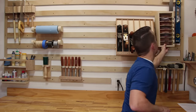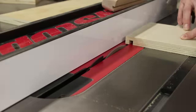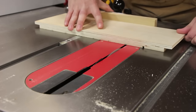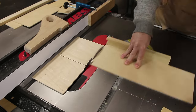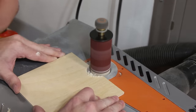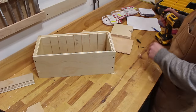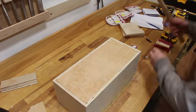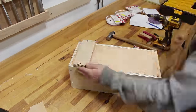The next tool holder is an organizer for all my sandpaper discs. I made a basic plywood box and cut a rabbet in either end for the corner joints. I then cut thin dados for shelves in each side with two passes on the table saw. The shelves were cut from scraps of quarter inch ply with a rounded notch so a finger can easily grab each sanding disc. I routed a groove along the back inside edge and recessed a quarter inch backer board inside this groove to close out the box. Finally, after attaching the cleat, I printed some labels for each grit and loaded it up.